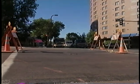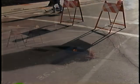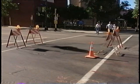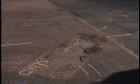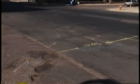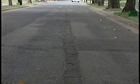Or it could be that the soil was just not suitable for compaction. It may have been too wet, too dry, frozen, or it may have contained too much organic material such as roots or peat. Finally, it could be that the crew simply neglected to compact the soil at all. And this cut probably wasn't compacted well enough because the repaired area was too narrow for the compactor to do an adequate job.